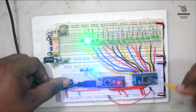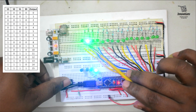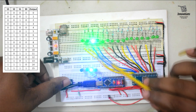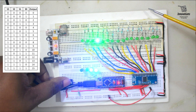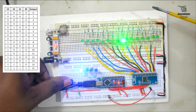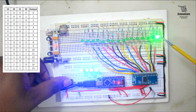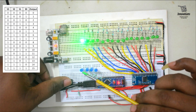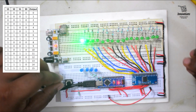I am pressing the button one time. You see now the binary value is 0001, so C1 pin is connected with the signal pin and that LED is glowing. Moving to the next: 0010, and C2 is connected — so that LED is glowing. Likewise, as the binary value increases the output LED moves one by one. At the end when all the selector pins are 1 it is connected with C15 and the C15 output LED is glowing. Then back to all zero, so C0 is selected again.